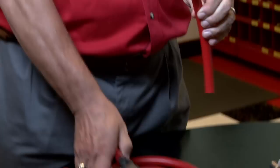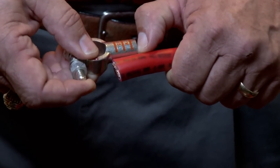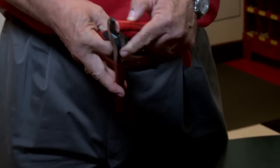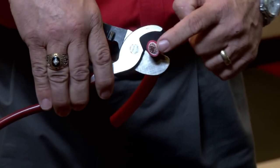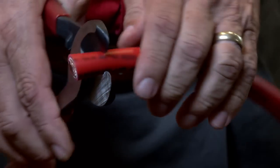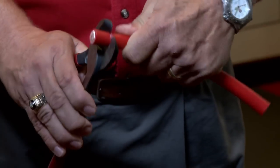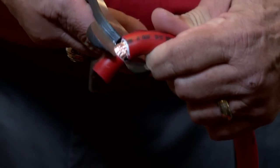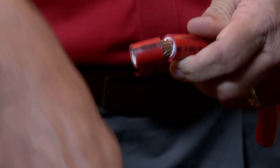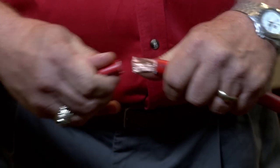It's just pretty much like a knife through butter and you can see it makes a nice clean cut. The next thing you've got to determine is how much insulation you need to remove. Take your cable cutter and open it up. This time you're not wanting to cut through the cable — you're just cutting through the insulation, not trying to cut any of the wire strands. You simply put a little pressure as you roll the cable and the tool, and you'll see it cutting through the red insulation and the white insulation. Once it gets through the insulation, if you cant it just a little bit, you can see it pulls apart. You may need to carefully work it off — just like that, you've got a nice, clean, smooth cut.